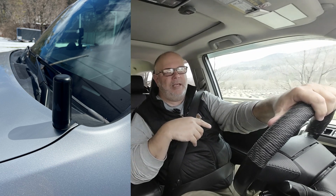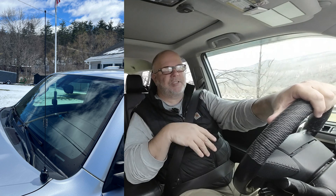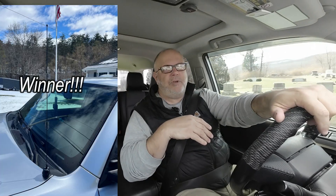So I think it's fair to say we have good communications with your portable and my radio with the big antenna — let's call it 7 and a half miles line of sight. It turns out Bob's extended range antenna is not really an extended range antenna; it's for different bands, so we didn't end up using it. We swapped from my 3 dBi gain Ghost antenna to the 5.6 dBi gain antenna, and our line of sight was about 7.5 to 8 miles. The performance increase over the 3 dBi Ghost antenna was not very significant. You only need to go to a bigger antenna if you're operating in a fringe area.